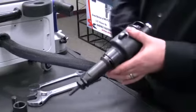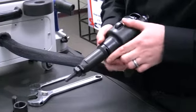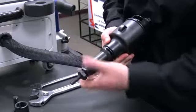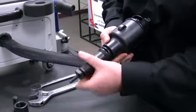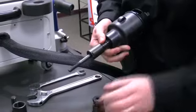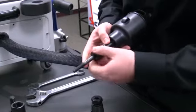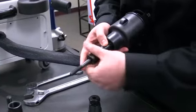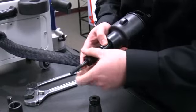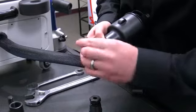On thread sizes 12 millimeter and half inch and smaller, the Flex 18 uses a socket head cap screw mandrel. To change the mandrel, all you have to do is remove the nose piece, then remove this casing. Inside is the socket head cap screw and the hex driver.